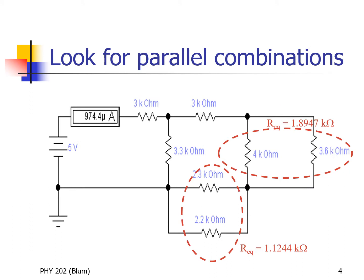I've inserted my two equivalent resistances: the three kilohm at the top and the 3.6 kilohm on the right. Now I look for parallel combinations. The four kilohm resistor and the 3.6 kilohm resistor have a wire connection between them on the top and a wire connection on the bottom, so they are a parallel combination. Applying the reciprocal addition approach gives an equivalent resistance of 1.8947 kilohms — carrying more digits than strictly needed, but for accuracy.